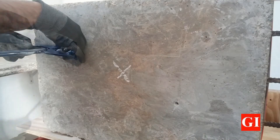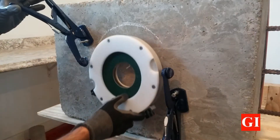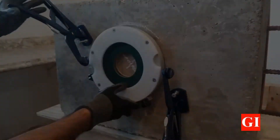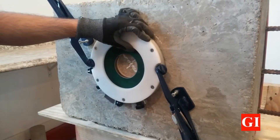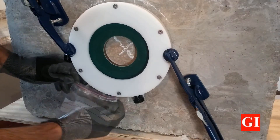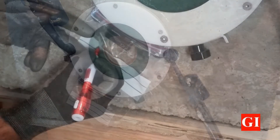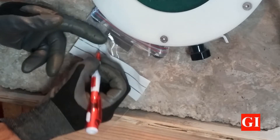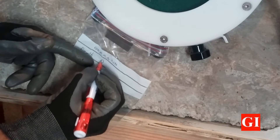Once the anchors are fixed to the structure, attach the clamping pliers and then attach the grinding guide plate. In order to collect all the ground dust, a bag holder was implemented on the grinding guide plate. Make sure to tag the bag with the corresponding project information and the depth range of that specific grinding increment.